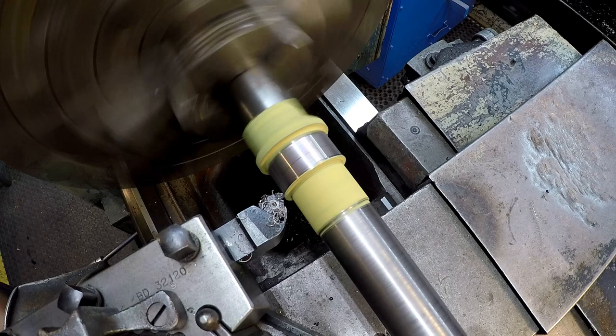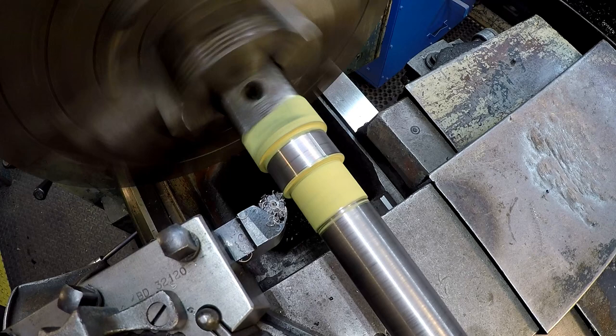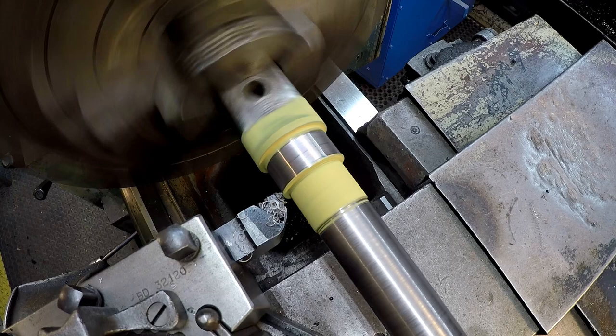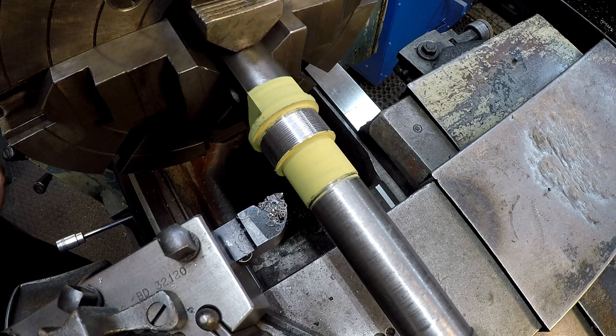All right, we're gonna come back and I'm gonna set up the quick change here to cut a fine pitch. All right, we got it set at 26 threads per inch. I'm gonna go another 15 thousandths on the dial here. We'll make one scratch pass and then pull out the end there. Just like that. And that thread helps give that powder more surface area to bite and hold on to whenever it's sprayed, and helps bond to that surface.